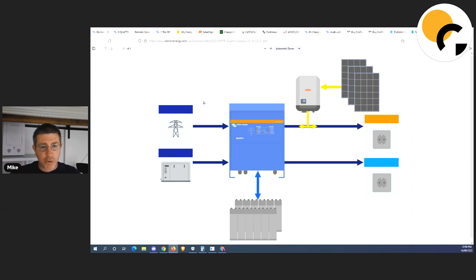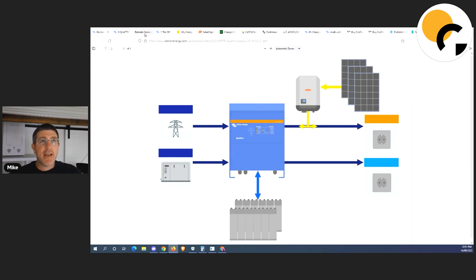If you were looking at my system design, I've got the grid and all my grid-connected inverters on the grid side, then I've got my Victron, batteries and off-grid setup. Nothing charges the batteries except my generator, so in a blackout situation I don't actually have any solar panels on that output. If you wanted your solar system working in a blackout to charge the batteries and didn't have a generator, you'd want the panels over there — but in my experience over the last 10 years I've had a blackout when the sun was shining maybe once or twice in my whole life.